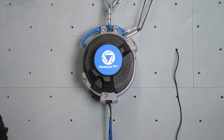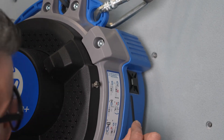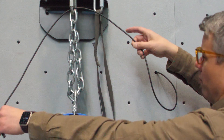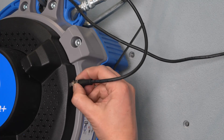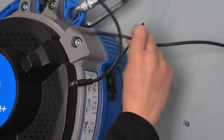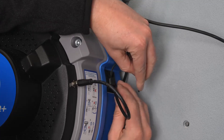Once you've figured out how you're going to run the cables, the next step is to take this releasable cable tie and insert it through the tie holder on the side of the device. Then you can go ahead and route the cable through the primary mounting point so that it won't get damaged when the device starts to swing. You'll want a small amount of slack in the cable, just to make sure it's not pulling on anything. Line up the pins with the connector socket, then screw the silver end until it's finger tight, and fasten down the cable tie, leaving some slack to keep the cable from tugging against the connector.